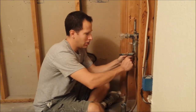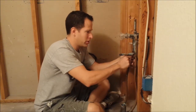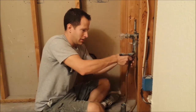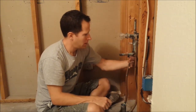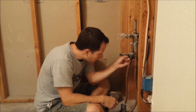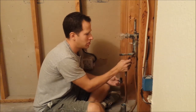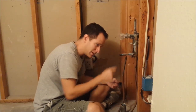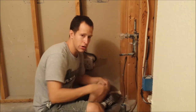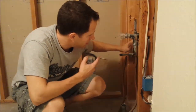It's also a good idea to find the lowest plumbing area in the house — in this case it's the toilet. The toilet's got its water line down low, so go ahead and open that line just in case. This is a pretty old property; when I turned off the water there's still a slight drip, so that's dripping over there and not on me while I'm working. I just cut through the copper pipe — it's a nice clean cut. I'm going to clean that off, and that's where I'll put my next fitting. I'll cut the other line and get those PVCs prepared, then come back and show you the process.